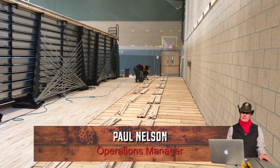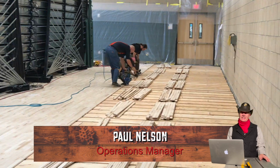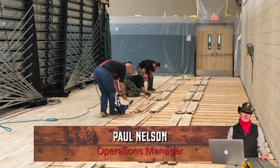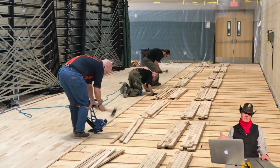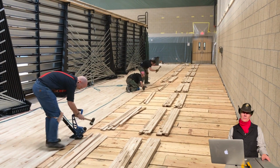We have one nailer, and you'll see this guy coming along. He's nailing very consistently and precisely. He's putting two nails in each one of these panels, maintaining a 9 to 10 inch spacing as he comes along. Once in a while, as a board isn't setting right, he'll take a deeper, harder stroke with that hammer, but generally he's taking a pretty even stroke all the way up along.